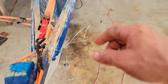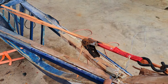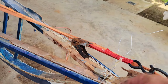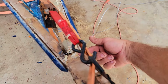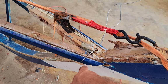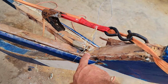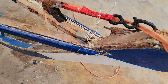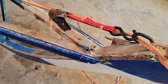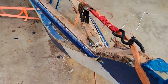You can see some of the wood down there. I came back in with construction adhesive, put a big bead in behind there, drilled through here, sunk in long wood screws into there, and also coated them in construction adhesive as they went in. So actually what I did is ran a hole, pumped construction adhesive in the hole, and then re-ran the screw back in just a little deeper, so it's completely embedded around the threads with glue.